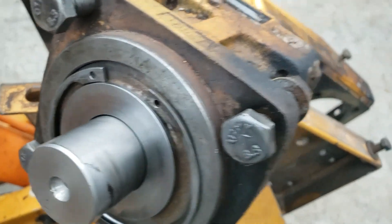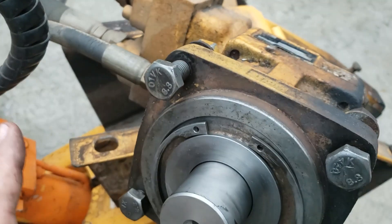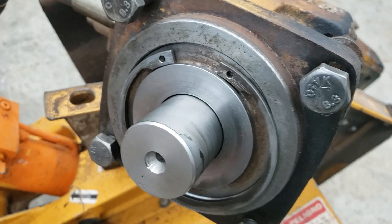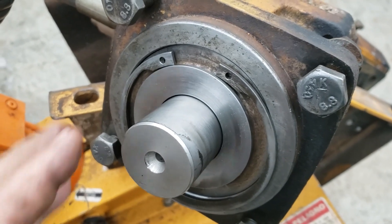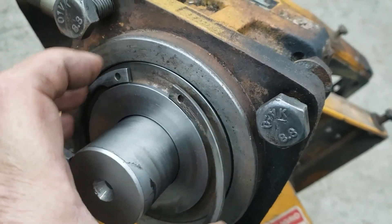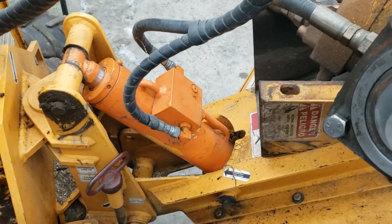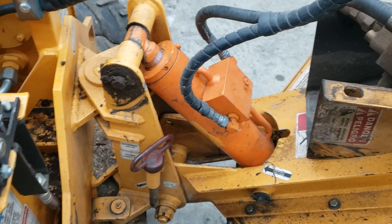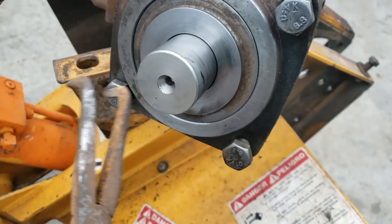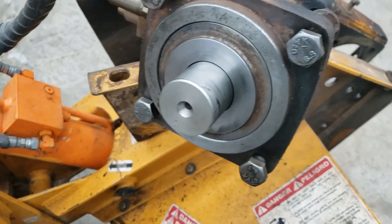After you take off the wheel and flip your pump up like I did — instead of disconnecting my hydraulic lines I left them on — it's high enough and steady enough to work on right here. It's got a large C-clip to take off. I've already done it and it's a pain to get off, but you can get it off. What I used was a pair of needle-nose pliers with the bent ends — sharpen them up a little bit — and I was able to expand it and pop it right off with a screwdriver.